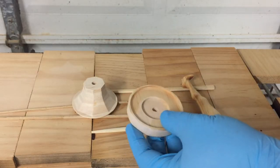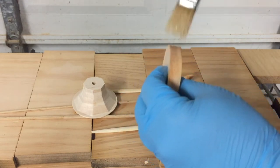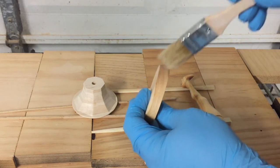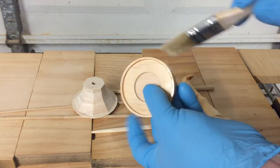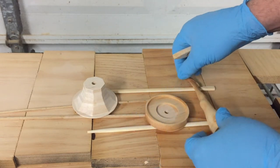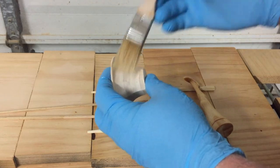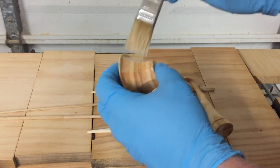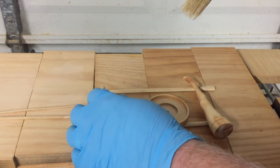I'm going to sand it up and I'm applying a seal coat of denatured alcohol mixed 50-50 with Bullseye Zinsser Seal Coat, which is a 100% de-waxed clear shellac. I'm sealing this because I'm going to go over this fringe area of the lamp with a paint pen to draw in some fake fringes, and also going to paint the stocking band and the shoe black with a black paint pen. So I'm sealing this all first, then I'll give it a light sanding and see if I need another coat. If so, I'll just slap on another thin coat and sand it down again. I'll let that dry and be back with you in a few minutes.